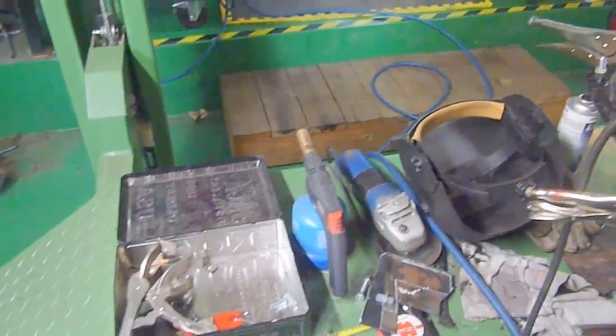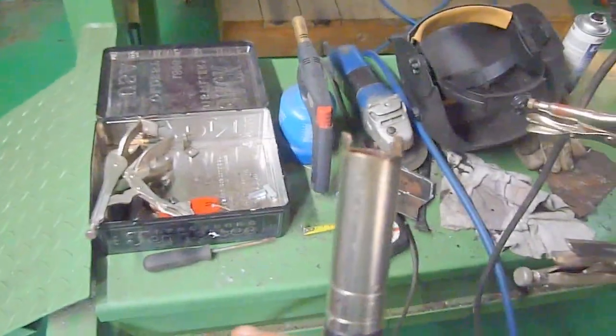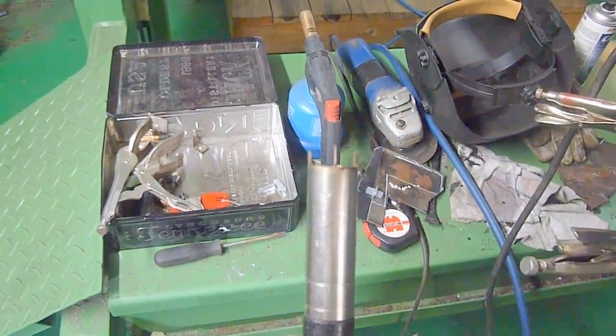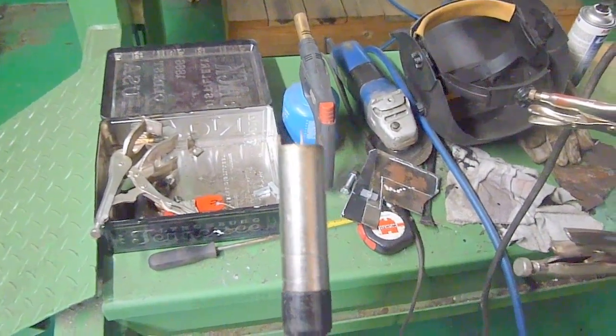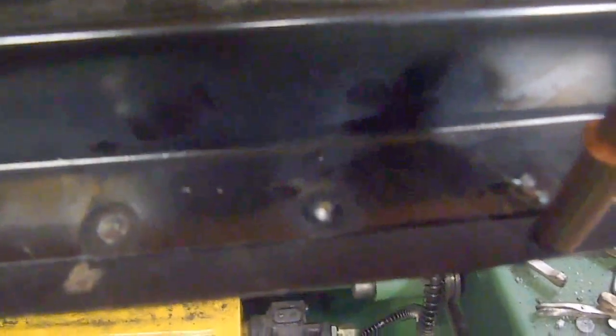As far as MIG welding is concerned, if you've got a situation where you want to recreate spot welds, this tool has basically got two legs on it. So what happens is when you put it onto the metal, as you go down onto it, you get the perfect standoff. So you've got the right gap every time and you'll get a nice weld. The kind of weld you can get is something maybe like this.